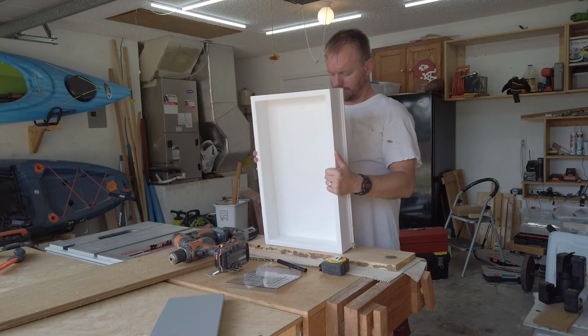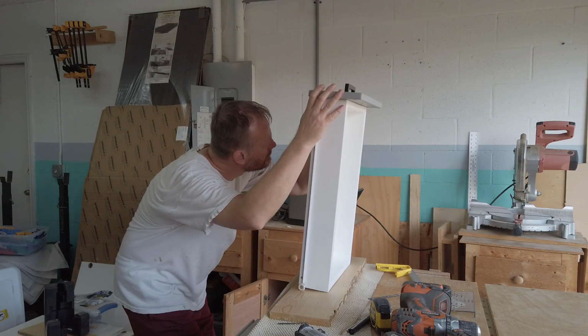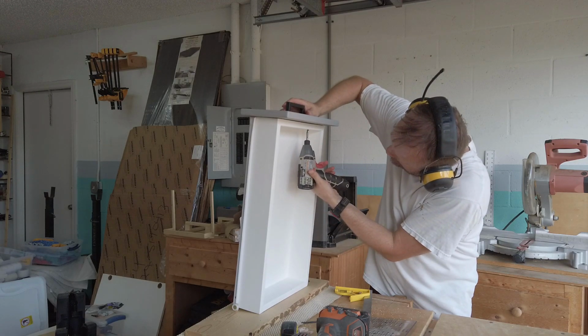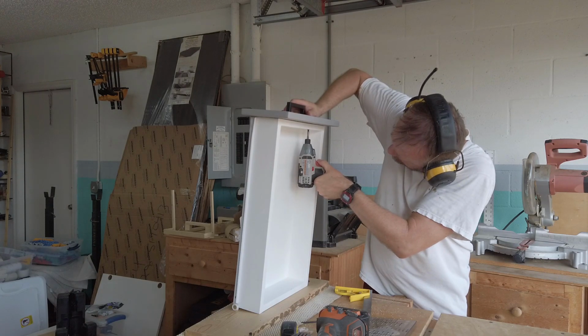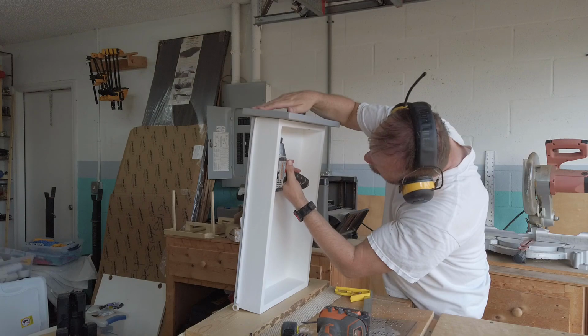Take the drawer back out to my shop, realign the profile mark I just made with the drawer, and remember those 2 random holes I drilled earlier? Use those to set 2 screws. That false front is now securely set in place. And we are done. Brand new kitchen drawer for a kitchen remodel on a budget.